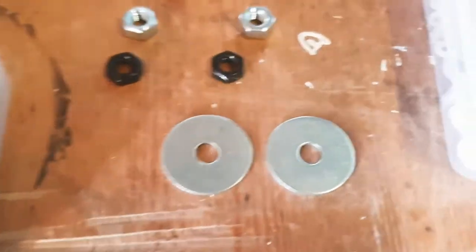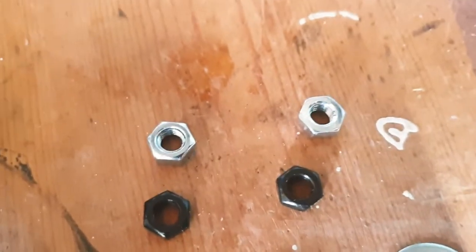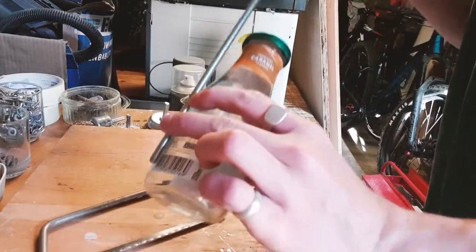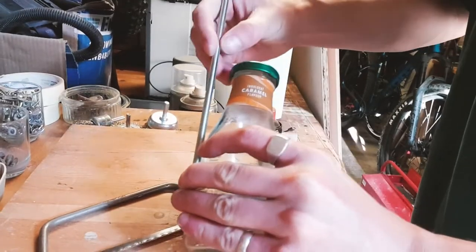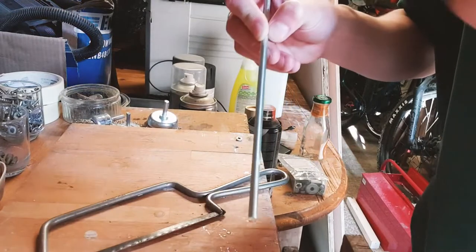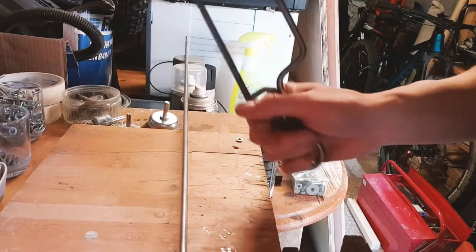Welcome to the garage. In here I've found a couple of big washers, some M6 bolts to hold things onto the cap, and M6 all-thread. I'll cut some of that down to size — enough to fit into the bottle and on top of the cap. I've cut this all-thread to size so it goes down to about here in the bottle. I've got this hacksaw, but I don't know how long it's been since the blade's been changed, so I might have to get out my Dremel.